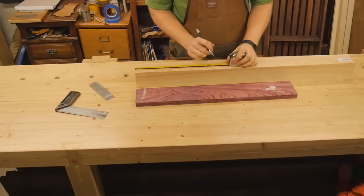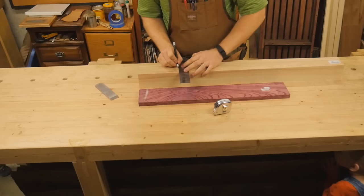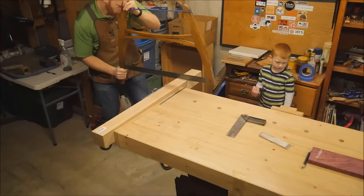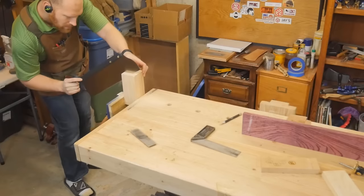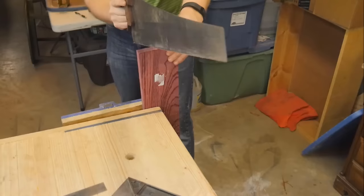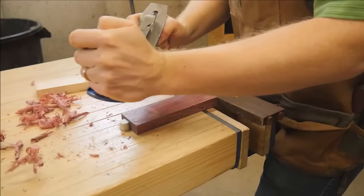So let's get on to the plane body. This is made of purple heart and ash. They're about seven inches long, and I'm just laying everything out. I'll cut them to length and then cut them to shape. Total thickness is about two inches and about three inches tall. Keep in mind that the ash and purple heart will overlap by about a quarter inch in the tongue and groove section. I love using my bow saws — they have a two TPI, so they make quick work of chewing through large items. Once cut to length, then I can cut the ash to the appropriate thickness.